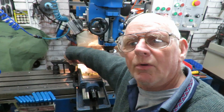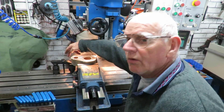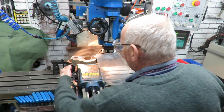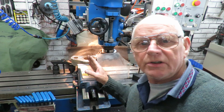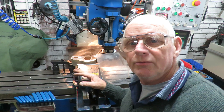Just toddling along. You'll see the difference between when we're first cutting in over the whole width versus when it narrows out to the section that's actually unsupported here. We've only got the clamping along the back straight but only in one spot. I've put some support underneath here but I can't do much about it. I could make up an arrangement with a bolt as well, but it's good enough for what I'm doing, so I'm taking off less than I would normally. It's a 4-tonne hydraulic vise so I'm not concerned about any movement.